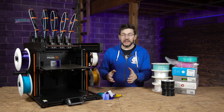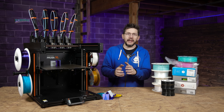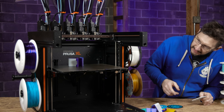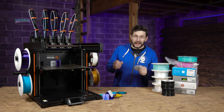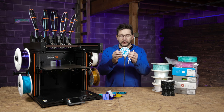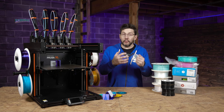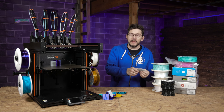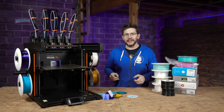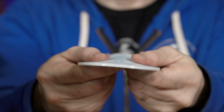To begin my exploration in multi-material, I wanted to throw some flexible materials at this. The XL uses an extruder with a very constrained filament path, which makes it perfect for printing flexible materials like TPUs and TPEs. I got out some TPU — a Fibrology Flex 40D — and one that just says 'flexible white.' What I did is try to make some really cool Mandalorian-inspired coasters I found on Printables. A coaster is a good choice because it lets me practice multi-material but isn't very tall, so it won't take long. So — Din Djarin, of course — printed in that Fibrology and the generic white.